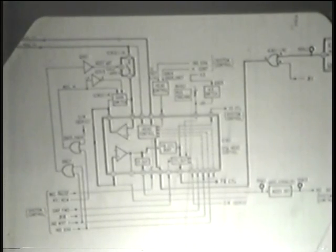One thing I found about indexing systems in the various machines we've had is if there's a slight tape pad there, or some wear on the CTL heads or dirt, anything like that, the first thing you lose is the index. They just won't pick it up, even though the tape is running by fine, and you know the index point's there.